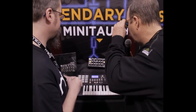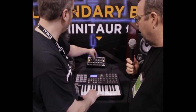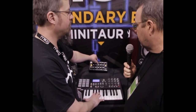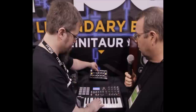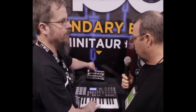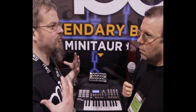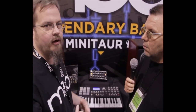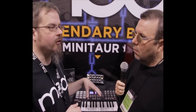It's two oscillators. Which filter — is it the classic Moog filter? It is the Moog Taurus filter, which is the same topology as the Moog ladder filter. Everything that we make has this topology. The Taurus filter design is a little bit different though, which gives it its characteristic sound. It has a little bit of overdrive in it — you don't hear it as distortion, but it adds a thickness and impact to the sound that's different from our other synthesizers.